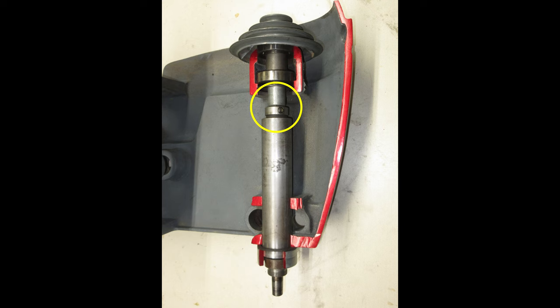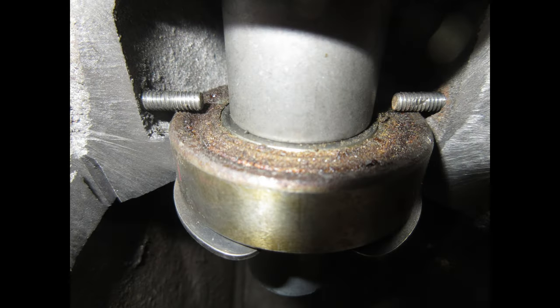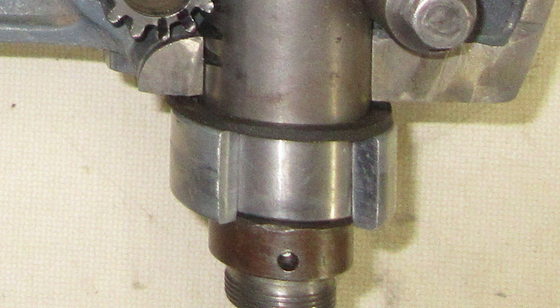Notice the gap between the top of the spindle collar and the bottom of the spindle pulley assembly is no longer present. More importantly, notice that the bottom bearing in the spindle pulley assembly is no longer resting on the outer snap ring. In this picture, the bottom bearing is almost completely out of its bore. Remember that there should be two machine screws that prevent the bearing from traveling up. This over-travel of the quill spindle assembly will either bend or break off those two machine screws. This is a common problem when acquiring drill presses and having trouble removing those machine screws, and it's completely avoidable by ensuring that the quill is fully seated inside the feed stop bracket.